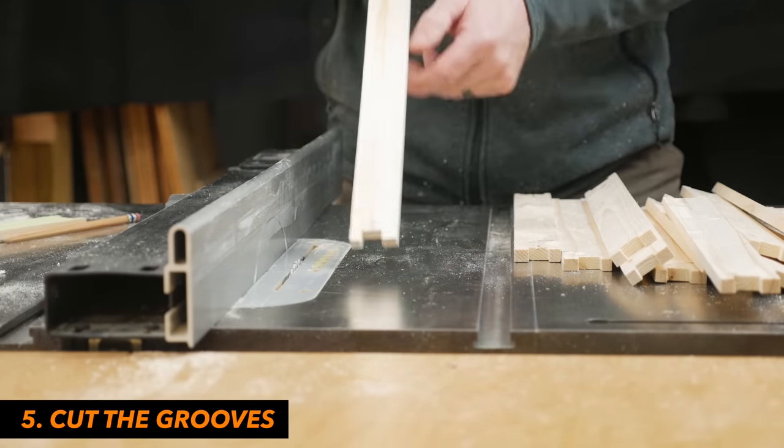For the jig, you take a little piece of material so that after material is removed from the frame, it has a place to ride up onto and be supported. Then you have two little guides that go on there, one of which is notched out, as a little safety zone. You put your frame rail in there and just roll it right in. The stopper defines the distance where you want the shoulder to end. Put your three-eighths dado blades in, place the jig over the blade, turn the blade on, and raise the blade up into the jig. Then put the five-eighths side — not the seven-eighths side — into the jig, roll it in, and pull it out to see the result.